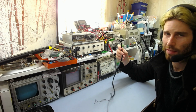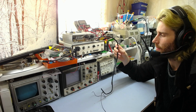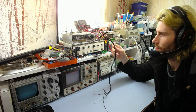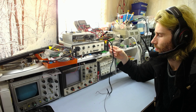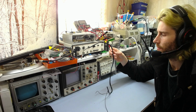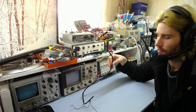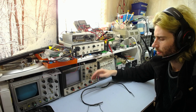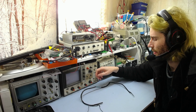I mean, like I said, even though this did work fine with the little switch mode power supply that this actually came with, to use it for anything else, especially anything above... I mean, in the initial experiment I did, I had this going at 5 amps, and even at that point it was getting soft and it was starting to smell very bad and it was very hot. And above 5 amps, above 6 amps, it was just basically beyond it, really. So yeah, I'd say, going by the diameter of the cable, probably only safe up to 2 amps, if that.